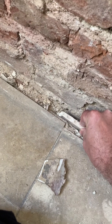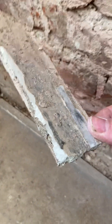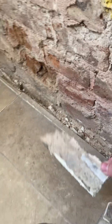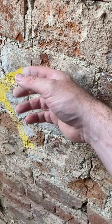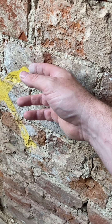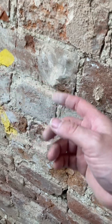What I found was that this gypsum plasterboard was going into the ground like this. When this stuff is in the ground it wicks up moisture. So the moisture was being wicked up the gypsum plasterboard, and there's a cavity between the plasterboard and the bricks — so the bricks get really damp, you get condensation, and when I took it off the bricks were soaking wet.